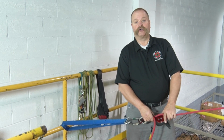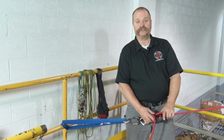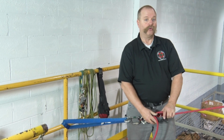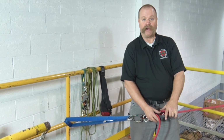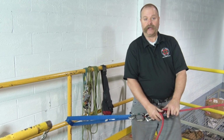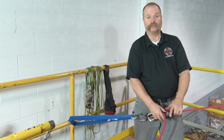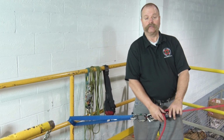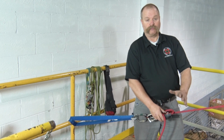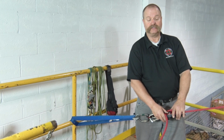All right, that concludes our little presentation on lowering systems and the incorporation of a raising system. Now's the time for you guys to get together with your team, head on out into the plant and practice some of this. Remember, as you're practicing this, if you're going to use live loads, you'll of course want to incorporate your belay system as a second point of contact for your rescuer. Again, refer back to the belay presentation if you need a little more information on that using the Petzl ASAP.